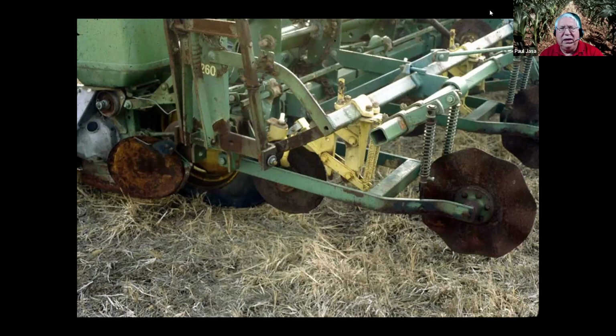I can go no-till. Well, when it comes to cut or handle the residue, in the early days, everybody thought you had to put a coulter on to cut the residue. Well, a runner planter can't cut any residue. A coulter would do that for them, yes. When it comes to penetrate soil to desired seeding depth, that coulter tilled and loosened that soil, and that lightweight runner planter could penetrate then as long as you had enough spring pressure on that coulter.